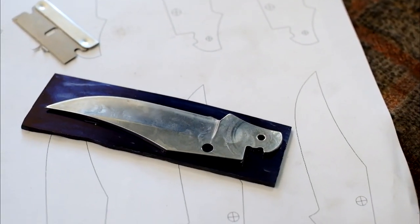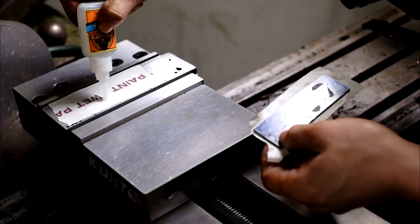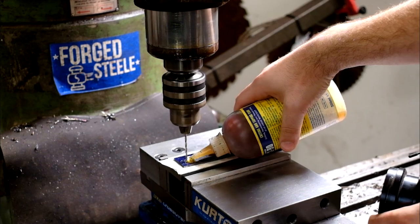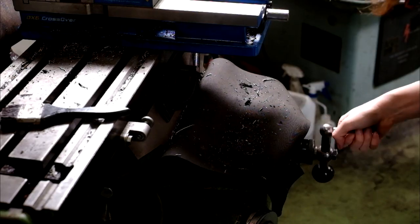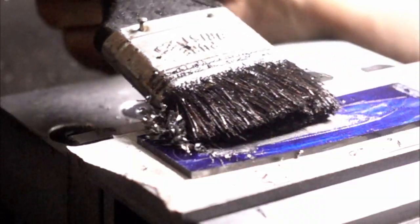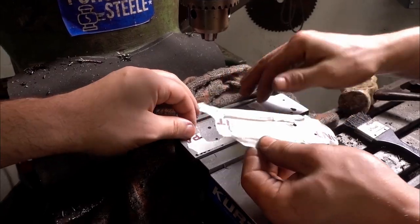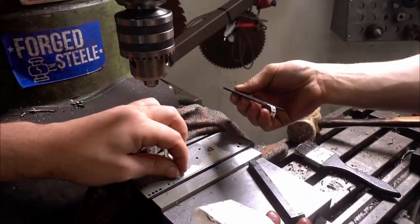So we had our outline scribed and our holes punched. So next up was drilling out the holes. We're gonna do a couple dabs of super glue to clamp our newly scribed and dykemed part. There we go. That breaks the super glue. The nice thing about this fixturing technique, thank you NYCCNC, is that neither of the parts have super glue residue. So now we have the holes drilled.